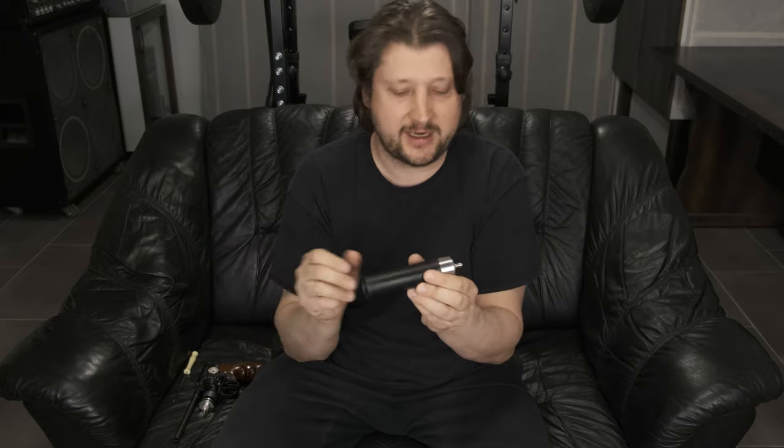There is one more mod that I really wanted to do, but I doubt that I will ever be able to do it, because it's too complicated and too risky. What I wanted to have is to leave this whole cylinder unregulated, and have the regulator just inside of this narrower part, which is now actually the plenum. And then I wanted to have the plenum inside the grip. That would be perfect. I mean, that would mean that you still have the full size of reservoir to be able to charge it to the full 300 bars. And the plenum size would be relatively big. You don't need much bigger than this right now, but a little bigger would help. Of course, I could reach, I don't know, 50 or 60 joules. So 35, 40, close to 40 foot-pounds, as it is with unregulated, for example.